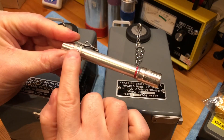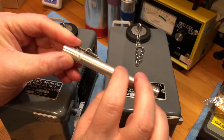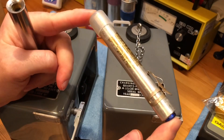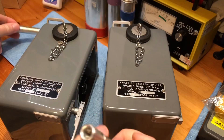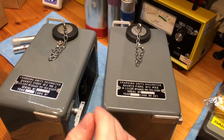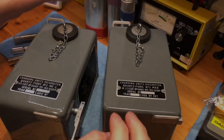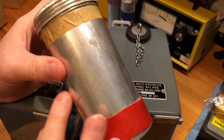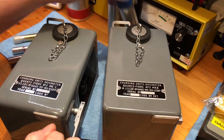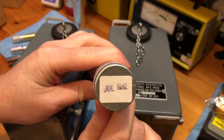As radiation acts on it, the scale reading gets larger — so as it's discharging, it is giving you your measurement. I have three different types: the oldest is zero to five roentgen, known as a training dosimeter. Then there's the red band one, zero to 50 roentgen, and the wartime dosimeter at zero to 150 roentgen. They all came in metal tins — a tin of five for your monitoring post crew in civil defense — then the blue one and the purple one, dated July 1982.